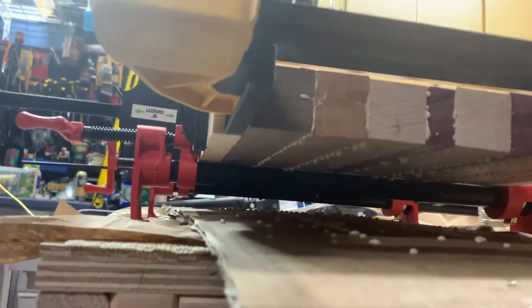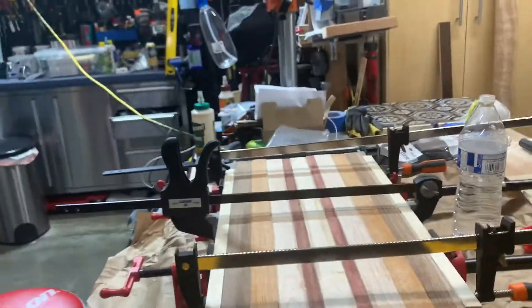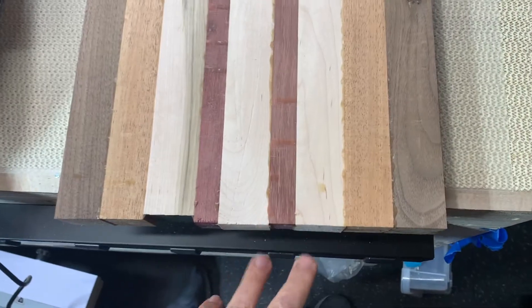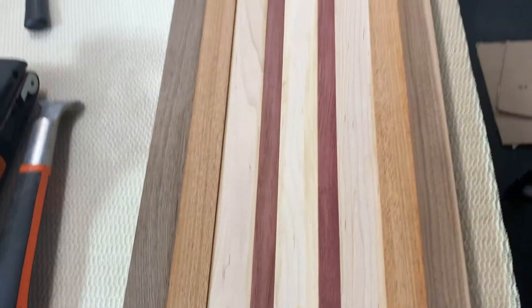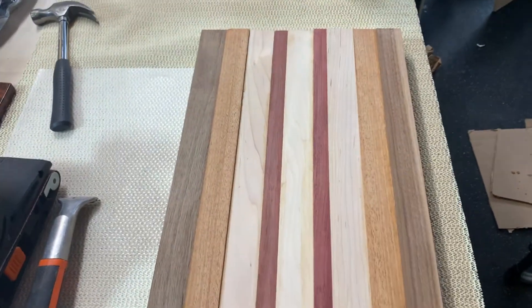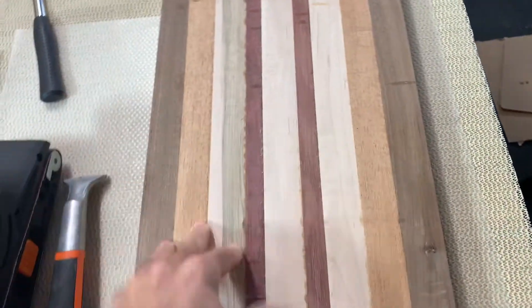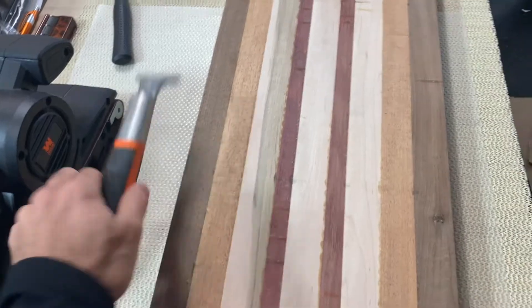You can put the board on its side, but I kind of want the glue to set before I start messing with it too much. Got this out of the clamps — this is the bottom side, top side here. There's a little bit of thickness variation; my glue-up was not 100% flat, but because it's still pretty flat, you can just run this through the thickness planer.